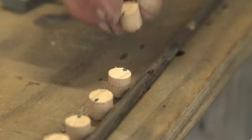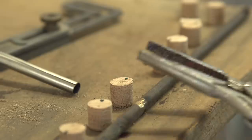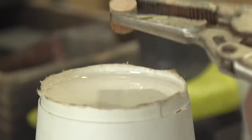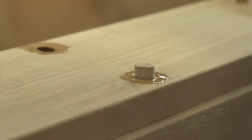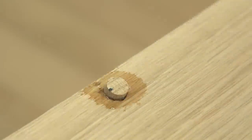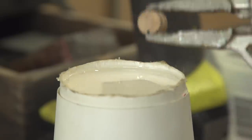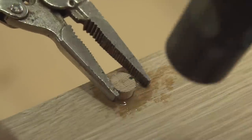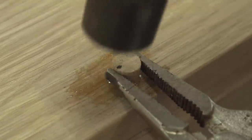I've got myself set up on the bench just the way I want — the plugs are on the other side of a piece of quarter-inch material, and it makes it easy because I'm a little shaky and I can set the pliers down on the rod and grab the height of the plug just right every time. Then I dip it in the glue on top of this cutoff cup, bring it over to the boat, line it up with the grain using that little dot, and drive it in. I didn't make this trick up — I learned it from somebody else, and it is the way to go.